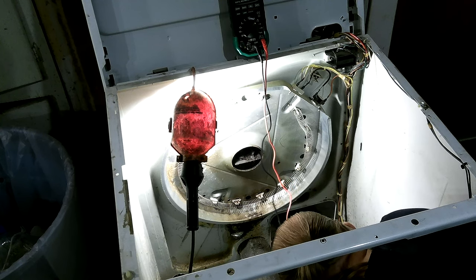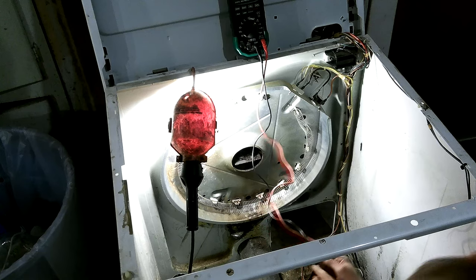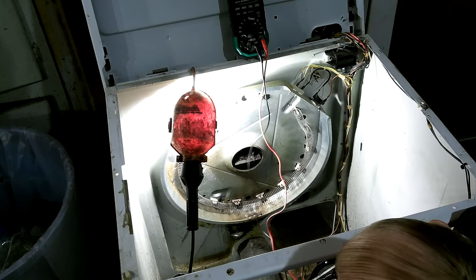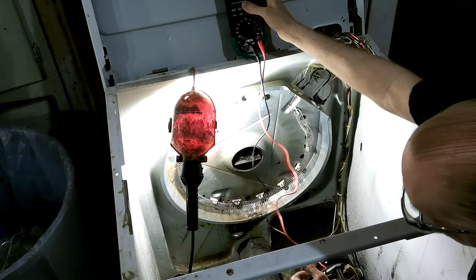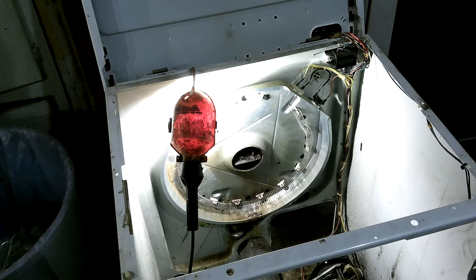One of them is black — I always think of black being ground because I'm more of a DC-minded person. People always get all bent out of shape about color codes, but there is no such thing as universal color codes — every manufacturer, every electrician uses what they want. In America, black wires are generally supposed to be one thing, white the other, green is ground. You need to know where they actually go. With AC you can figure out which one's hot and which one's neutral.